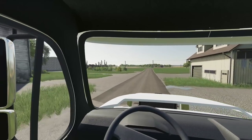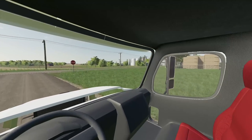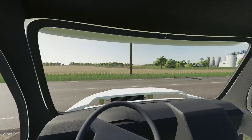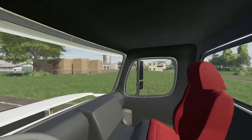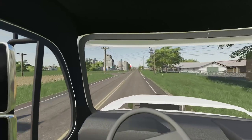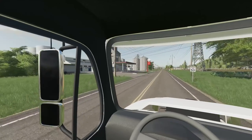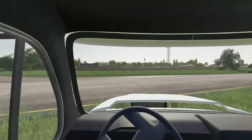We've got concrete in the barrel truck now. Since it's a fast-set concrete, the quicker we get over to the job site the better. A hot load is still a worry, but if I'm going to be honest, we run a risk of it setting in our drum sooner than we run the risk of getting a hot load. Nice and easy right across the median — don't get the big truck stuck.